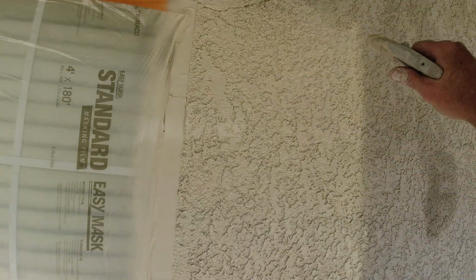Yeah, I'm using a 515 tip. What comes on those is a 517, and they work fine. You can do it with that. This is a 4-finger spray gun, a $300 Graco Silver gun, and I'm using a flat tip. You can get a flat tip setup for that gun as well. The flat tips are a lot cheaper.